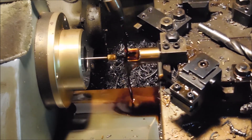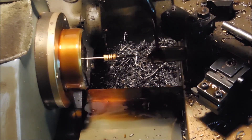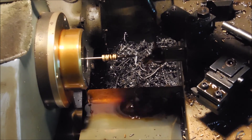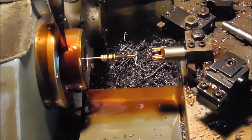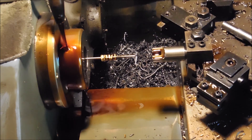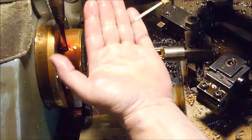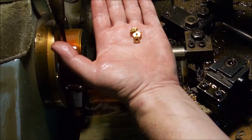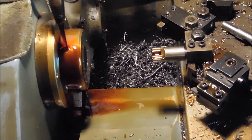There we are. See that? Look at that. Make sure there's no chips in the holder because that will foul it up. Then you just release the collet and there's all your tapped nuts. That's how it's done. Pretty neat, eh? Are you kidding? Thank you.